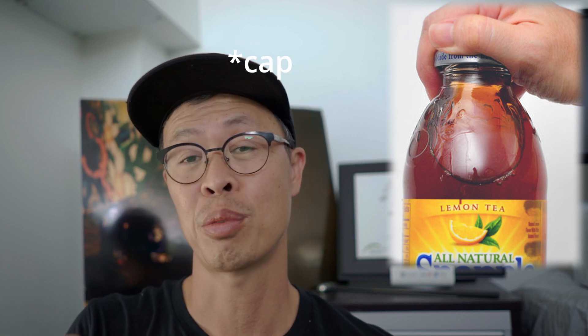An analogy you can think about: do you remember those Snapple bottles? The Snapple bottle has a lid that's like a ring, and when you undo it, it would pop. There's some floppy metal in between the ring of the cap — they intentionally make it bigger, a larger surface than what the ring can contain, so it can either sit high or low. That's why you get that pop in and out. In metalwork, there's a situation where the metal gets overstretched and because it doesn't come back, you have more surface than the perimeter. Like the Snapple bottle, the perimeter is fixed, but what's in between has more surface, so it tends to pop in and out and never really sits flat.